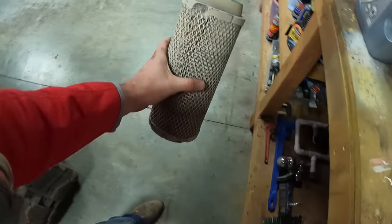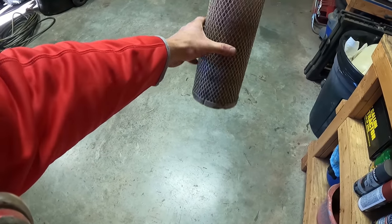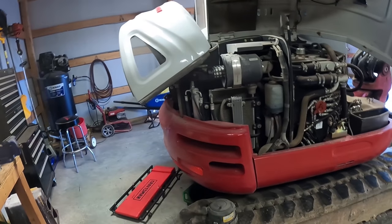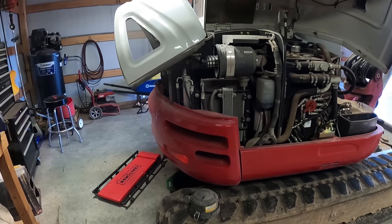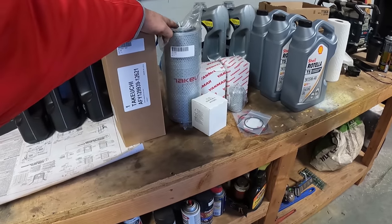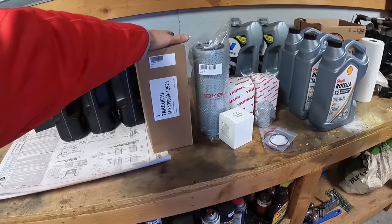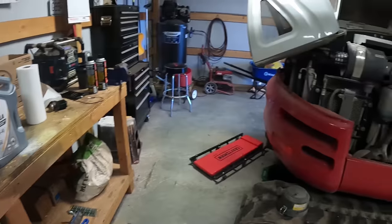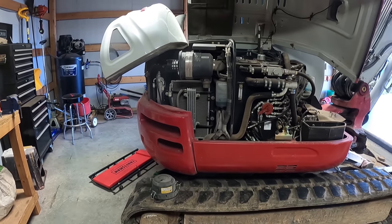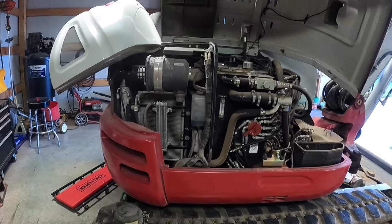Yeah, it's not bad. I'm sure it's a little dusty. I'm going to go ahead and just replace it just because it's been so dry and dusty, and I've got one. I know they don't recommend it, you can just blow it out and put it back in every 1,000 hours, but I've got it. I'm going to go ahead and change it, and I've actually looked, and 1,000 hours is only when you have to change the hydraulic filter and the pilot line filter. I'll probably still change it, because that seems like a lot of hours to let those go. Like I said, I've already got them, and I kind of do everything overkill anyway, so it's not going to hurt to keep them changed out.